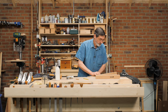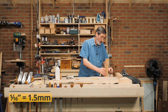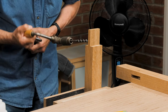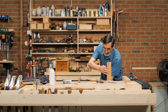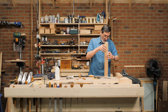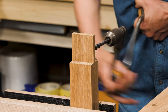Now this is important — don't go the wrong direction. I'm going on the inside by about a sixteenth. I need it to line up along the tenon but not on the width of the tenon. It slid off because of the growth ring, so I'm going to move it over to correct for that. There we go — just bore until that snail comes through again.